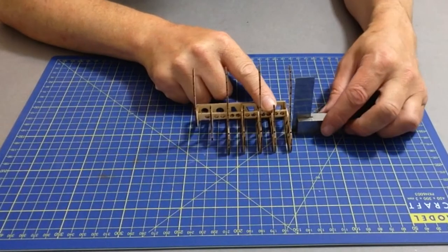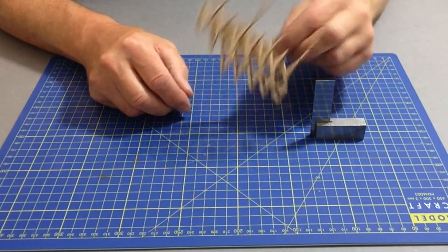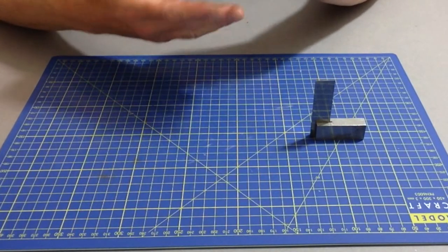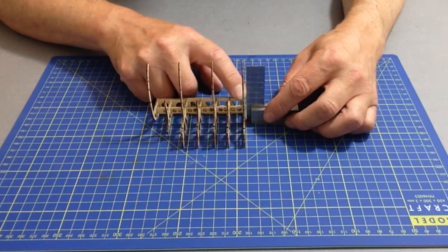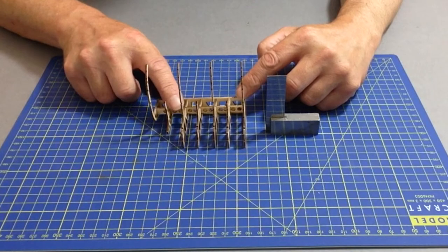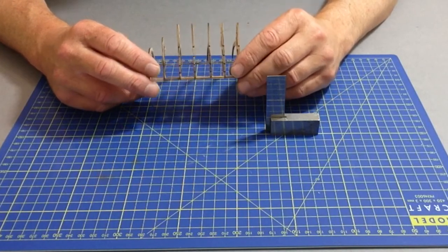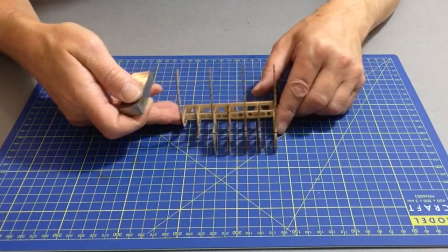Double check that everything is sitting nicely at 90 degrees. You will notice a slight curvature because of the rib frame — it's not going to sit perfectly flat due to the curvature at the bottom of this section. Hold it flat and place your right angle in the bottom corner; you should be at 90 degrees. It will rock slightly on the ribs because of the bottom curvature, so make sure all ribs are perfectly seated in, but do not worry that they're all sitting dead flat — that's due to the curvature of the fuselage for aerodynamics.